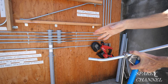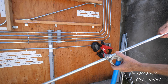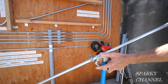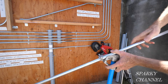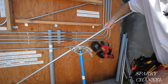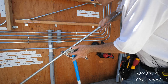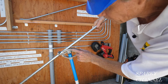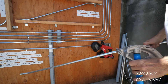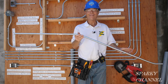Push it in — I just spun it 180 degrees so this is sticking straight up — and push it right down to the second line. Check again to make sure you're in the same plane as the first bend. The line is right on the arrow. Put your boot on the handle of the bender for safety, confirm you're in the same plane, and bend to 22 and a half degrees. There you have an offset bend.